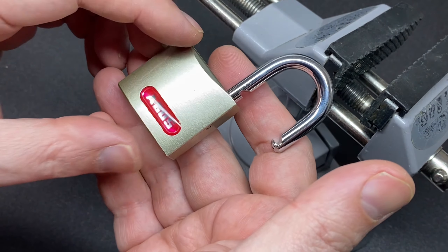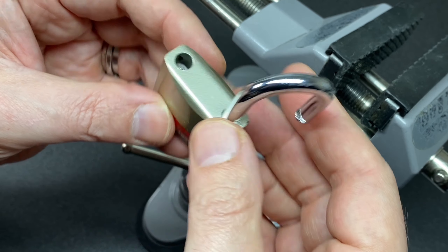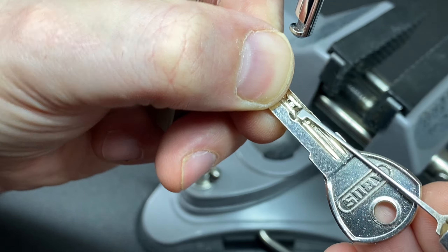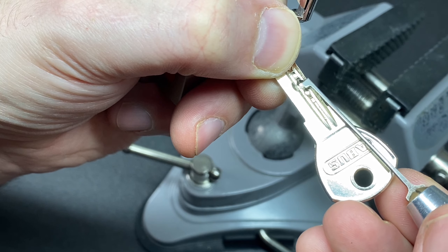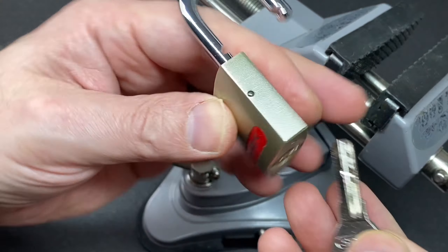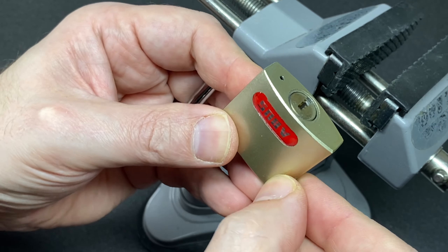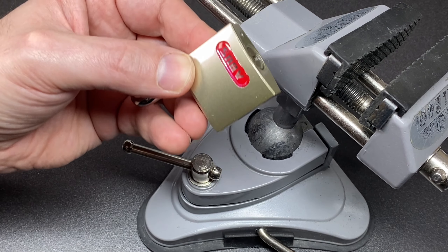You may or may not believe me, but that was completely blind, out-of-the-pack pick. Quite simple. The pins felt smooth — this was actually a zero-lift situation. Although I didn't mention it while picking, I did have to release some tension because I'd overset it, then pick the pins in front. It was a bit better than I was expecting, but not by a lot. The weight of this makes me think it's possibly magnetic as well — it looks like it's made of some kind of cast iron or pot metal, so this is not a good quality lock.